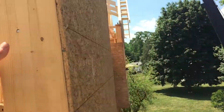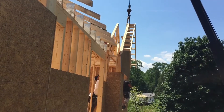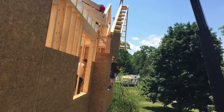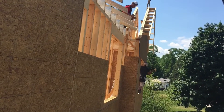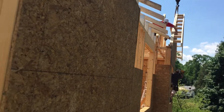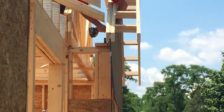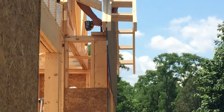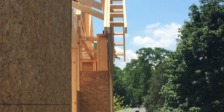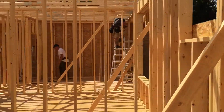From the front you can see they're going to nail the OSB right away — since it overlaps right into the wall, nailing right through it will secure that gable truss to the front. The other guy is going to drive long 8-inch screws right into the double plate through that 2x6, which also acts as a nailer when you're doing your sheetrock. So it's connected: truss to the 2x6, and then to the double plate.